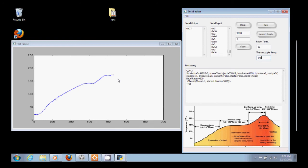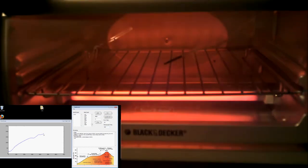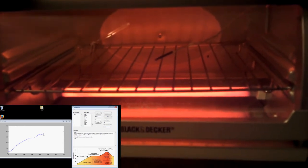You'll see this ramp rate increase quite a bit because our max pulse width is going to basically increase to 100%. The duty cycle here on this waveform is going to be about 100%. We've got full power on. This is getting pretty hot. You can see why I've got this lifted up on hammers, and it might make you a little nervous. Because this is a lot of power and a lot of heat.